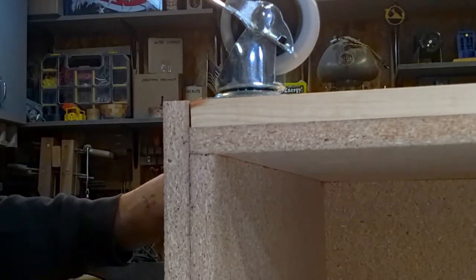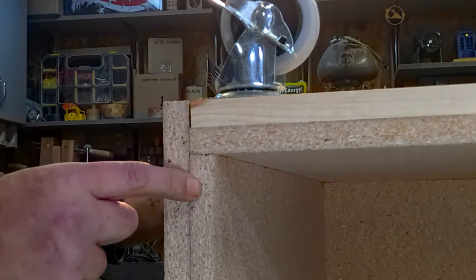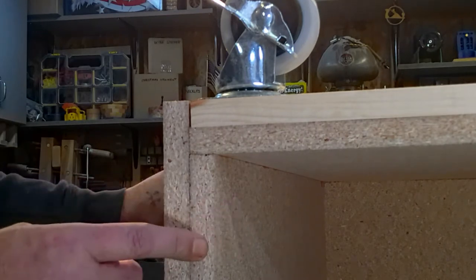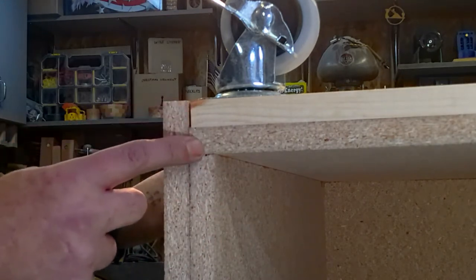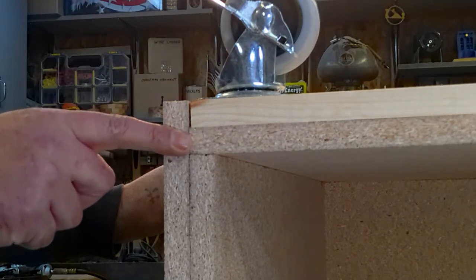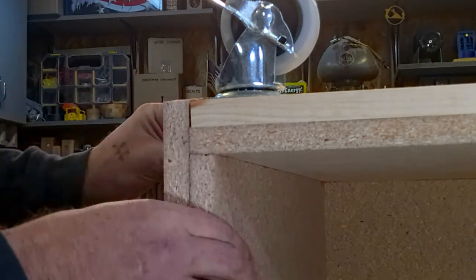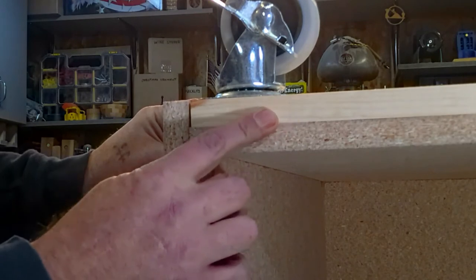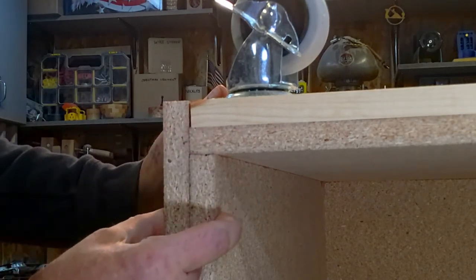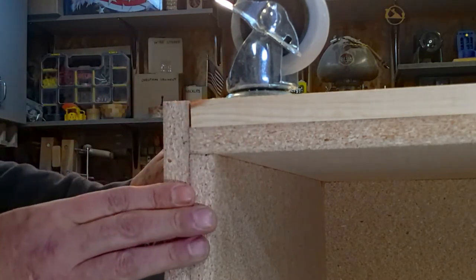Okay, this is upside down, and these are the sides and the bottom rails. I just wanted to point out that the inside of the sides and the outside of the sides were different sizes, and when we glued them together, it made this rabbet here, which allowed me to screw from the outside here and from the bottom into this one just by staggering my screws down the line. It's a super strong joint, and when we put the wheel runner on there, that gives us the inch and a half and inch and a half. It'll look uniform when it's all painted.